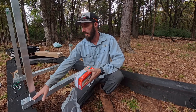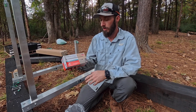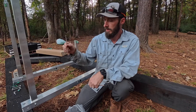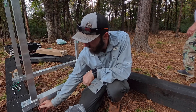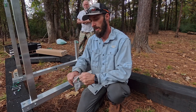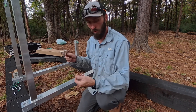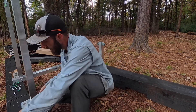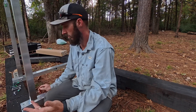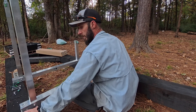To secure them, since we're not using the built-in ground spikes, we went ahead and bought some Simpson Strong Tie timber hex screws. These guys are going to go down in here and bite in pretty well. Because we've got to go through here, I went ahead and bought half-inch washers. We're also going to put one on top and bottom. It's not strictly necessary, but hopefully it'll eliminate water pooling under here.